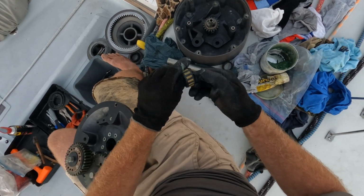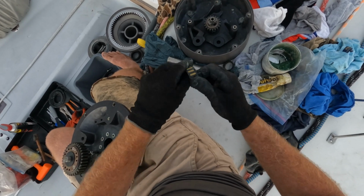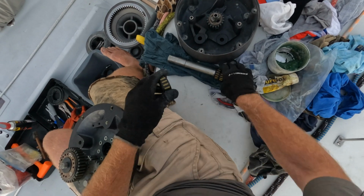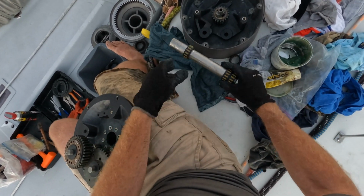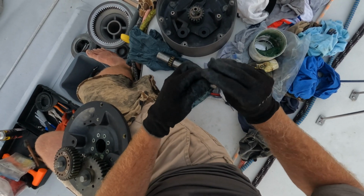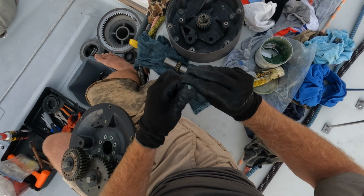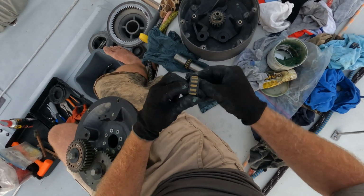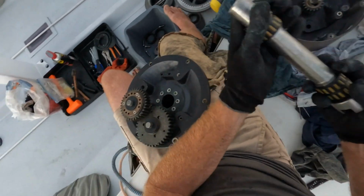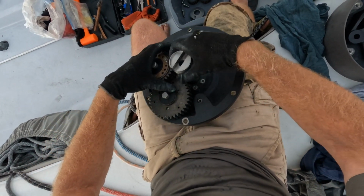happen. And to give you an idea, each one of these little pieces here would be about $1 each, something like that. If you rescue the race, the actual cage for the race, and that doesn't need replacing, each one of those would be $1. So they're like 20 odd bucks, even if you're just buying the individual components. I'm not going to be writing off all of the rolling stock inside a winch because a bloke down the pub told me. Okay, so that goes in there.